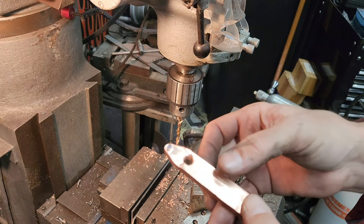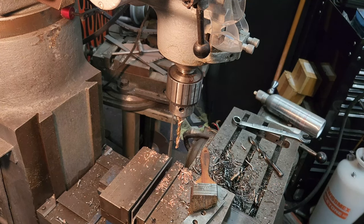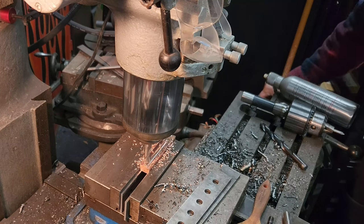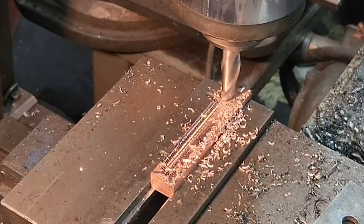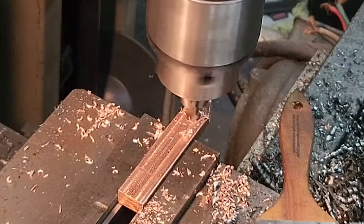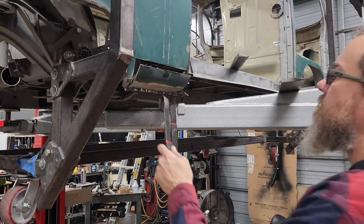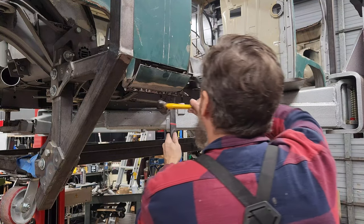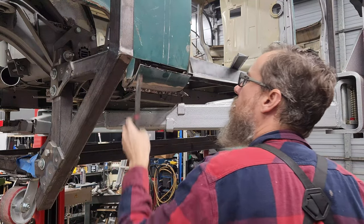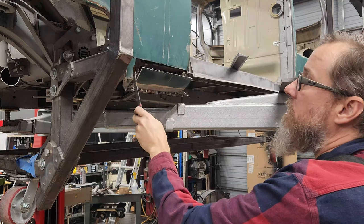Making a little spot welder extra thing here to get into a certain spot — I'll show you here, see if this thing works. We're going to do this — rocker panels in, getting this old stuff out. I'm leaving a little bit of the old fender so that when I put the new one in I know exactly where it goes, so I'm just going to leave this little part here for now.